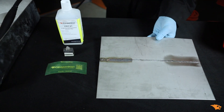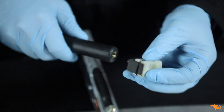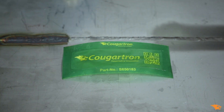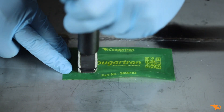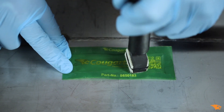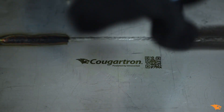The process is very quick and simple. Attach the clamp to the workpiece. Disconnect the brush from the handle and replace it with the marking head. Place your stencil on the surface. Then soak the marking head with marking fluid and slowly drag it over the stencil. The resulting mark will be crisp, clear, and permanent.